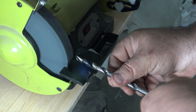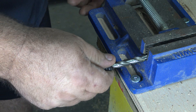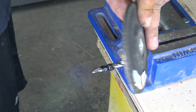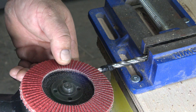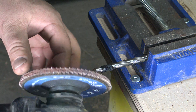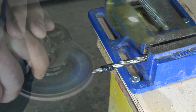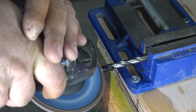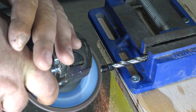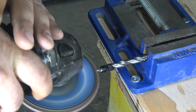Not everybody has a bench grinder, and it is possible to do this with just an angle grinder. When using an angle grinder, an abrasive wheel works great, but I usually start with a sanding flap wheel — it doesn't seem to heat up the metal as much. I hog out most of the material with that keeping the blade cool, then come back with an abrasive wheel to cut in the cutting edge of the drill bit.